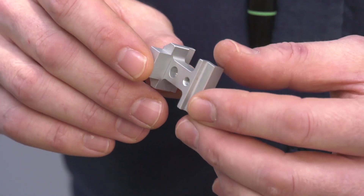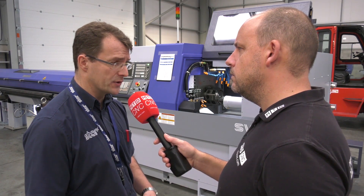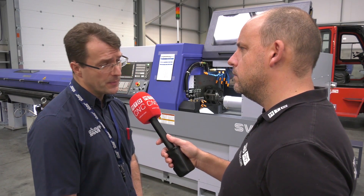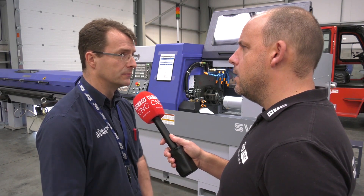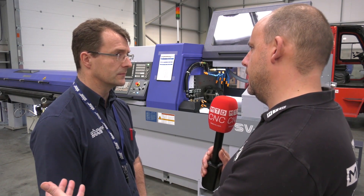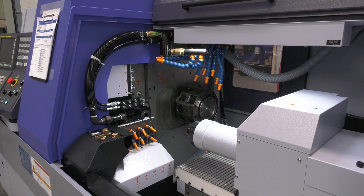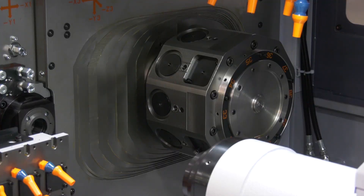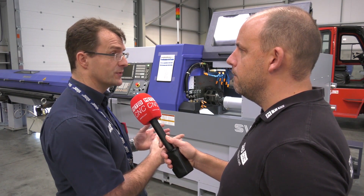Are you making setup quicker these days? We are. One of our key things is easy machine management — it's one of the philosophies we keep pushing towards our Japanese partners. That means special codes, special functions and features in the machine tool to make it easy to set and easier for the operator to handle. Similar to a machining centre where you standardise on tools, this machine comes with a pre-setter so you can set a lot of tool offsets for the turret before you even put the tools in, which speeds up the setting process for the customer.